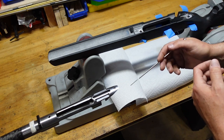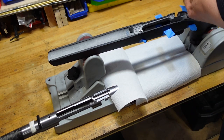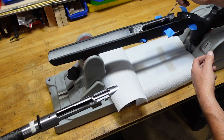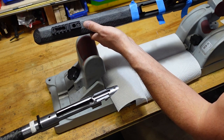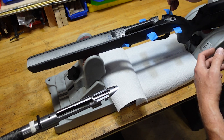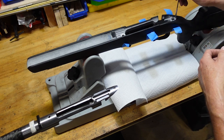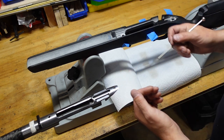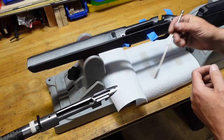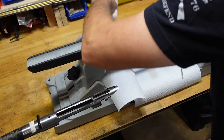About the cleaning process: once it's sucked down, you're going to have epoxy that runs down in the front and on the edges. You pop out the bottom metal and you'll be able to see all of it. Just take a little Dremel tool — or put it in the mill to make it cleaner — and Dremel out what you don't need. It'll go into the safety area on the stock, but you can clean all that up. While it's still runny, when you push the front recoil lug screw through, it will go through the hole, so you have to reach in and clean all of that out. I use a set of picks from Harbor Freight and a lot of Q-tips.